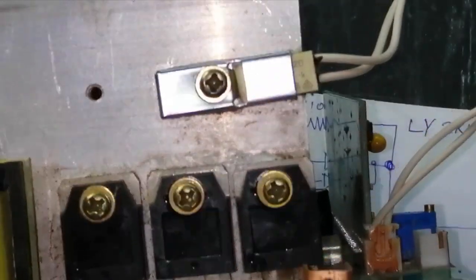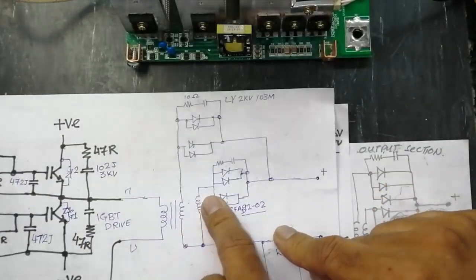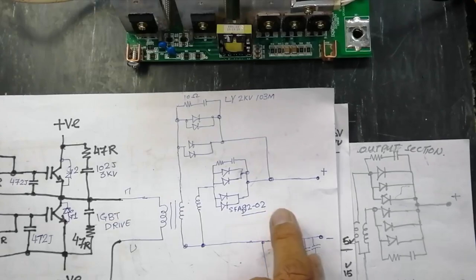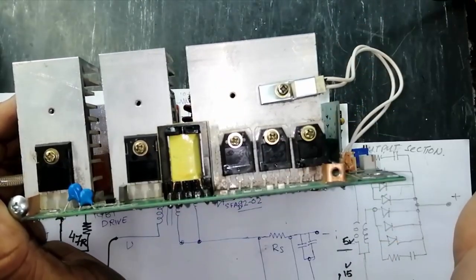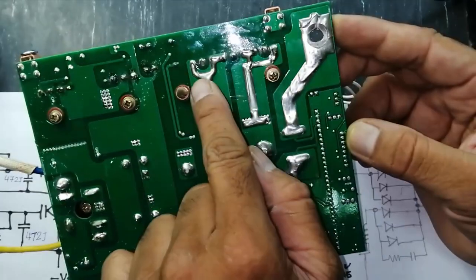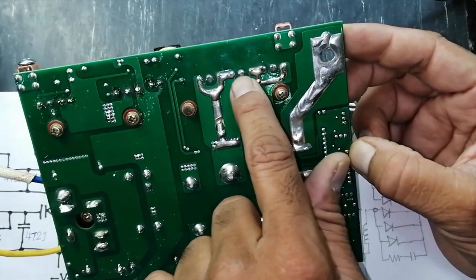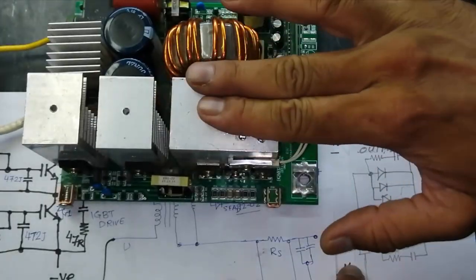In our last video we discussed four diodes at 20 ampere each — the diagram had one diode set, second, third, and fourth — four diode packs, 20 ampere each, that were D92-02. But if we see this design it has a difference: here it is 30 ampere diodes, but the current rating is the same. Here in one winding it is using one molded pack and one diode from the second rectifier; in the second winding, one complete diode and one end of the second rectifier. The positive is from this point and ground from this point.